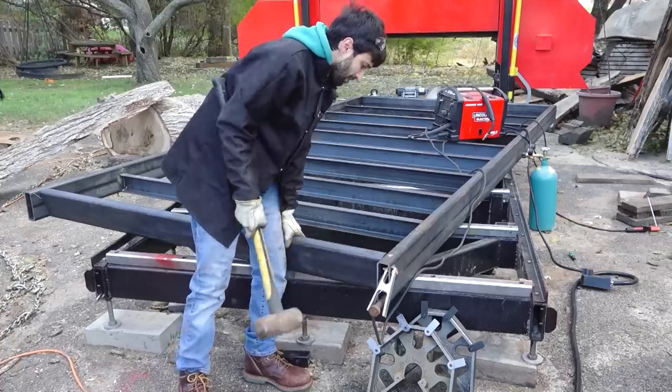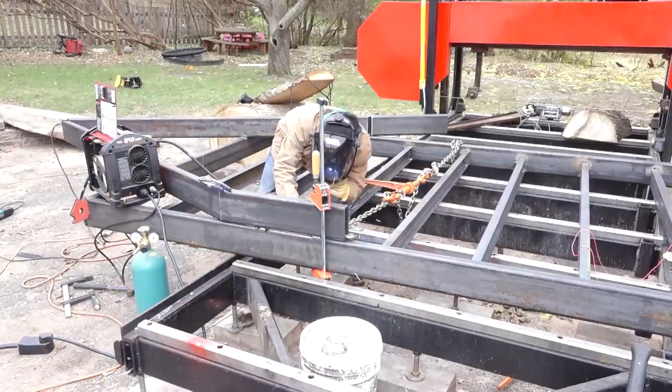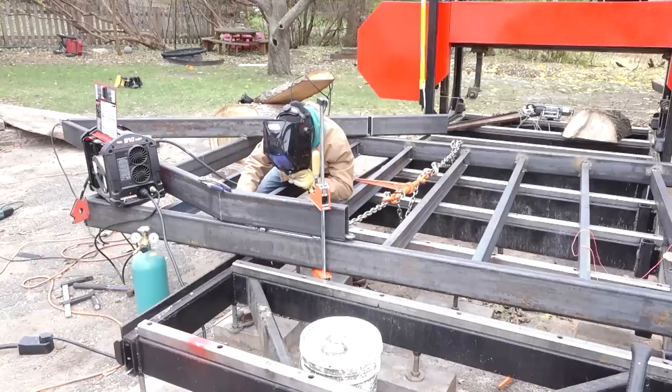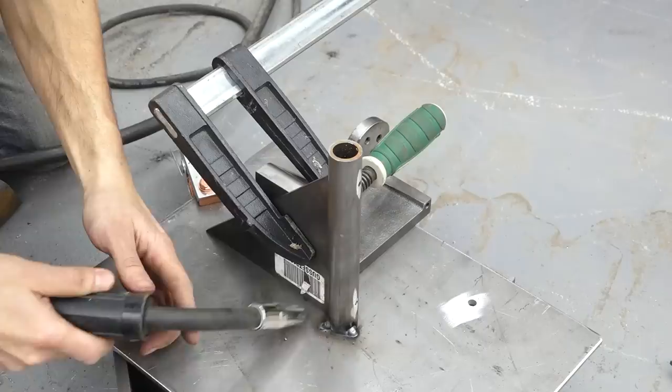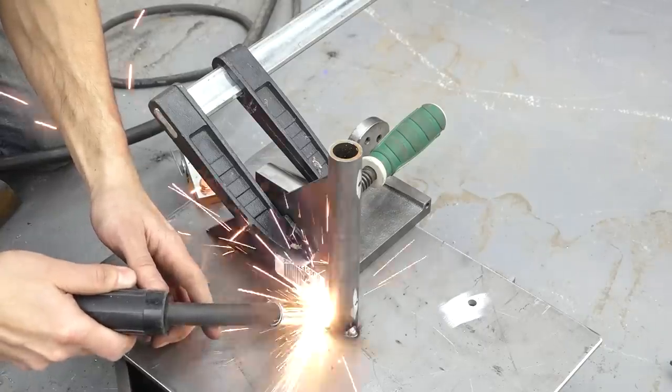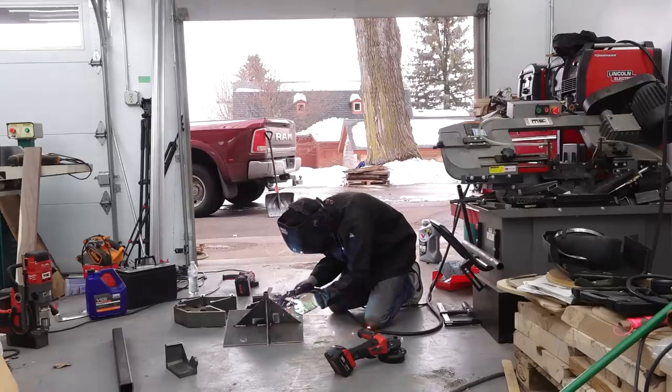It's six by sixteen feet, a nice flat area to work on. It's fantastic if you want to weld up an entire trailer frame or any other large project. But it does kind of lack when you get into smaller stuff — you don't have a whole lot of opportunity for jigging or fixturing because you're really limited to the spacing on the bunks being two feet apart. For small stuff I've been relegated to welding on the floor, which is not very efficient for your body or for being able to clamp and fixture things.